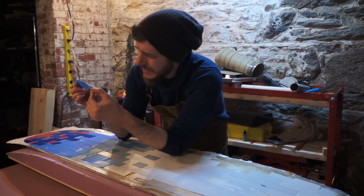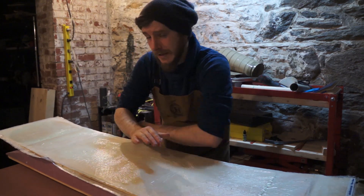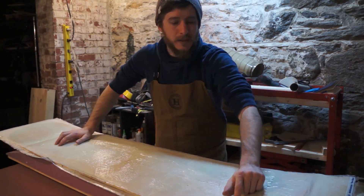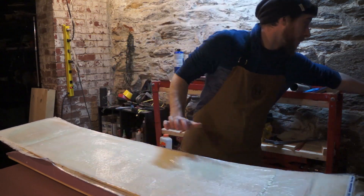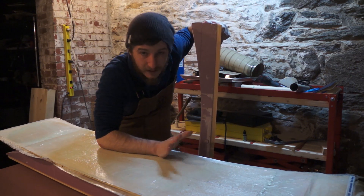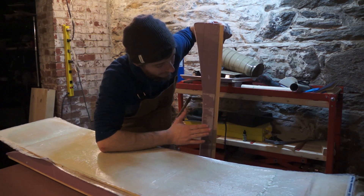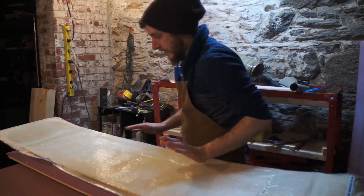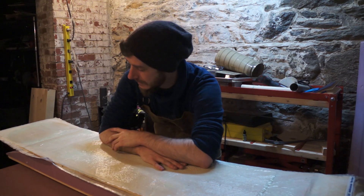I was totally bummed. As soon as I started pulling the tape up, these pieces — especially down here — the white plastic doesn't seem to have adhered very well. I'm looking at the pieces I pulled up and there's resin bonded to them — it's like the resin didn't stick to the glass. I'd been pretty concerned about this layup and I'm not really surprised it failed. The last straw was that when I went to press this, the places where the individual layers stepped down — I was hoping the foam mold would deform and squash down at those ridges. But it didn't. My clamping pressure may have been too low. That's a really good thing to know about insulation foam as a prototyping mold material — it's way more robust than I thought. For a two-piece mold like this, I'd want a really thin layer of much softer foam that can conform to all the curves.